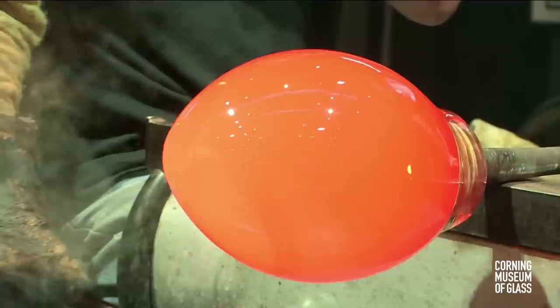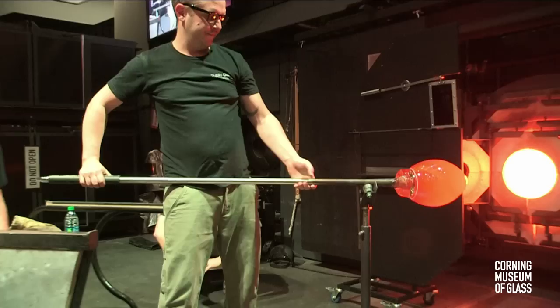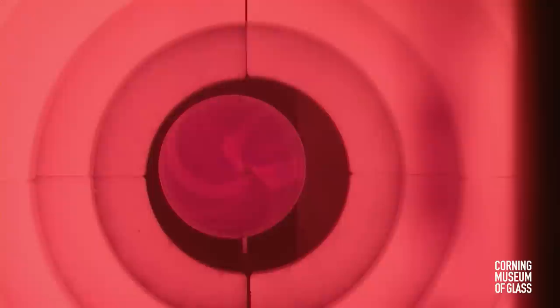Because you probably noticed already, there's constant attention and torque that we're always applying to the blowpipe, especially now with this being probably 25 pounds of glass maybe. The pipe that he has is about 25 pounds as well. You can't hold it all the way up because it's very hot on that side. And when everything gets hot and it's moving around, if you imagine it slumps off center, the torque you have to apply to get it back on center is very great. That can be costly on your arms, your hands, your wrists, and everything. So we're really trained as glassmakers to keep things running on center throughout the process, and it's easier that way. But if it tips off center, it makes it really difficult to manage.